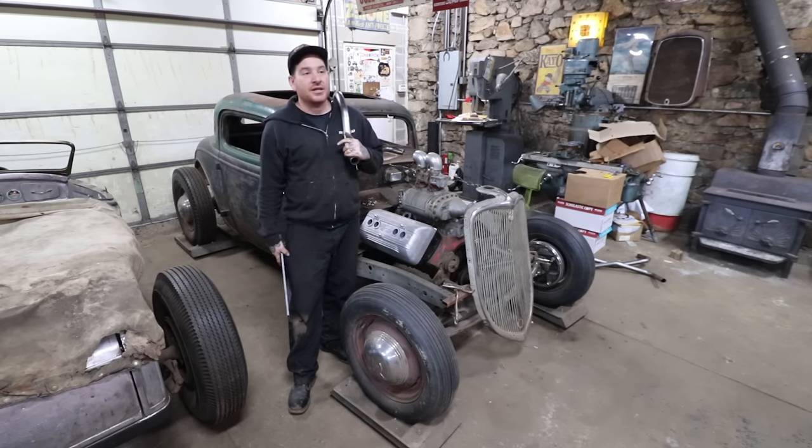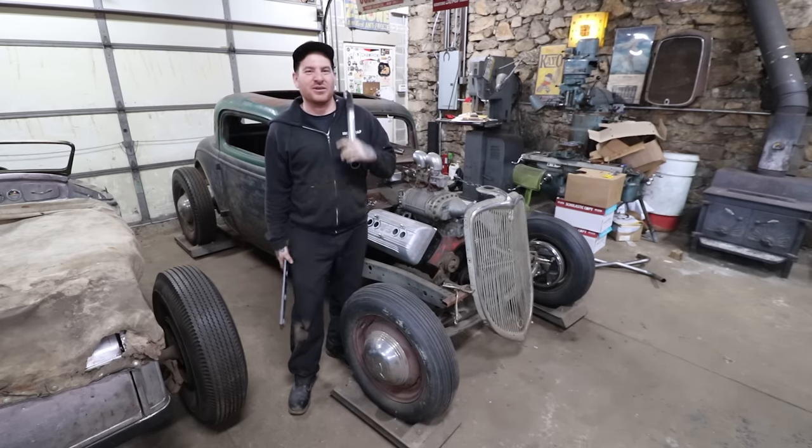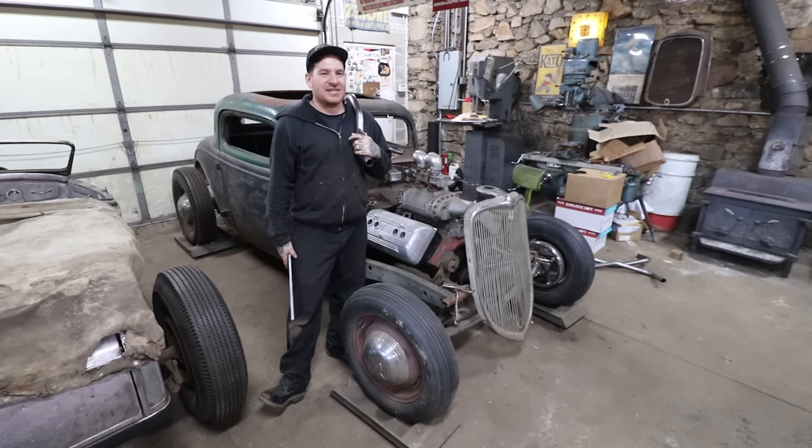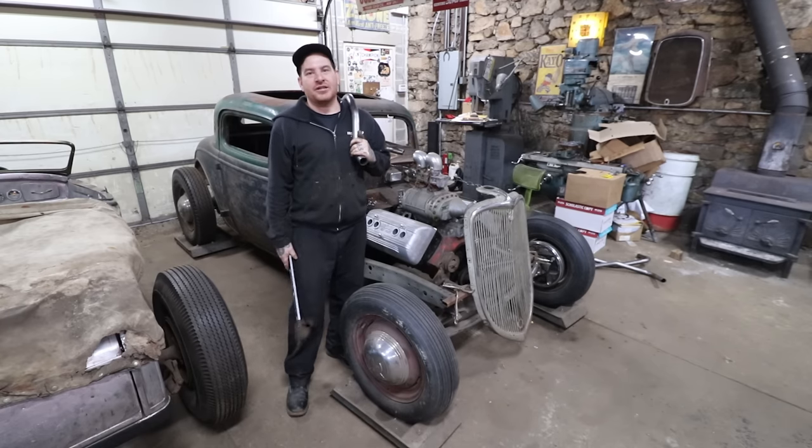I actually texted Ron, who's doing the engine, and he mentioned that the ports are like 1.46 or something. Of course, he knew the measurement right off the top of his head. So 1.5-inch pipe, he said, is acceptable for what's coming out of each of the ports.